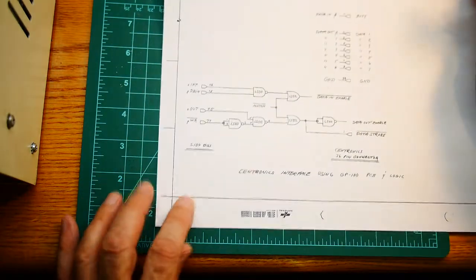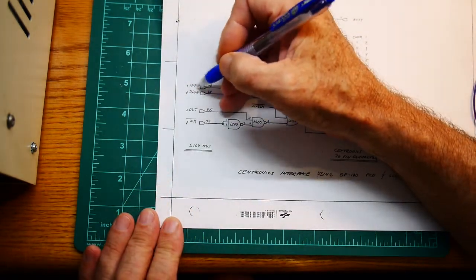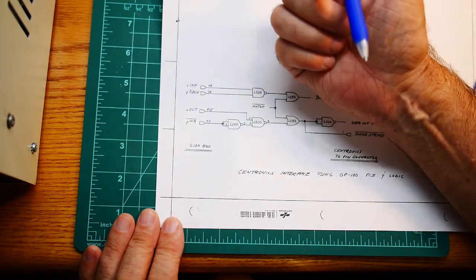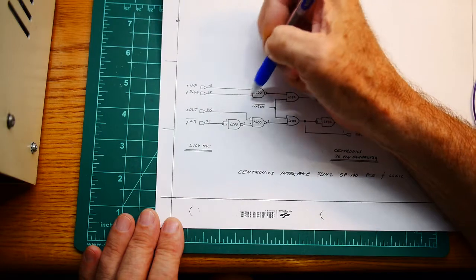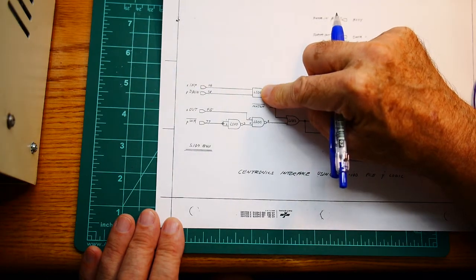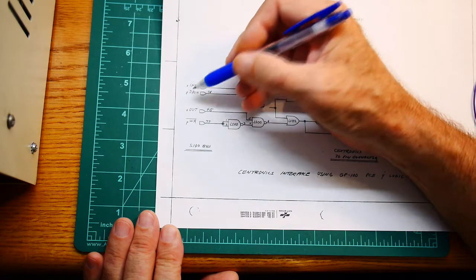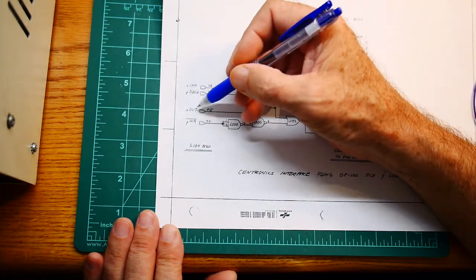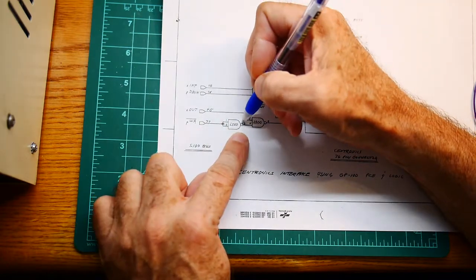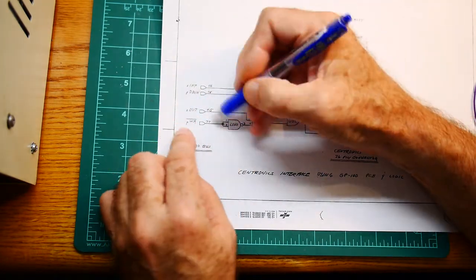I added this circuitry, which is basically a bunch of AND gates. There's an input cycle, which is a port input cycle, and there's also a data bus in saying the microprocessor is requesting input. So you need to AND those two together — both of these signals have to be true in order for things to be right. The same thing on the output: there's an output signal and basically a write command. Unfortunately these are all positive logic and this one's negative logic, so we need to invert it. So we have input ANDed with data bus in, and output ANDed with write.